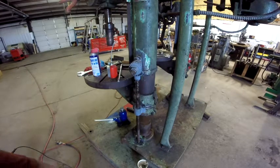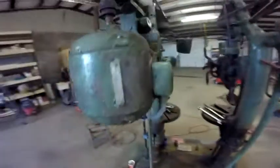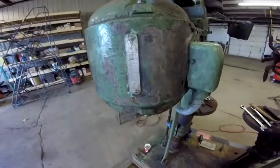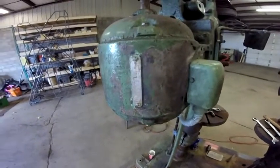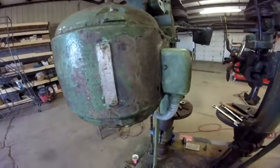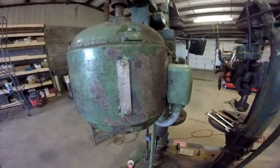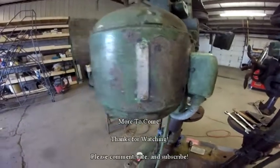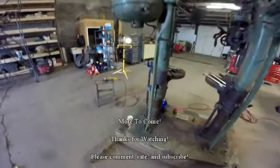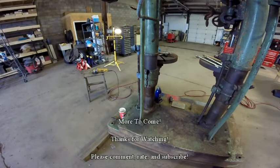One thing, I'm going to pick the tripod up and I'll show it to you. I got that plate cleaned off on the motor and it turned out to be nothing, but let me show it to you. All it is is a GE tag, and it's about wiring the motor for different voltages, I'm assuming the motor is 440, 220, 3-phase, so that's just a tag to wire the motor for, depending on the voltage that you're using.